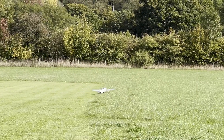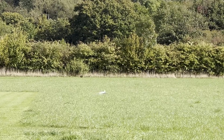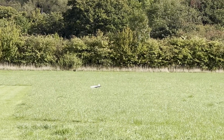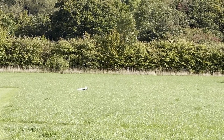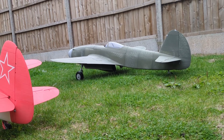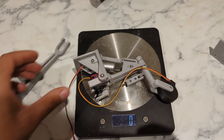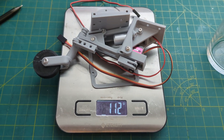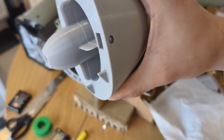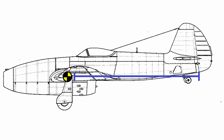This was the culmination of three months of design work. These results were sobering after the success of the Mach 4.2 — I lost sight of the fundamentals in pursuit of the right look. Before I designed airplanes I was an artist, and I'm still getting my practical experience with the constraints of this hobby. To get the weight down, I knew I couldn't run the tail retract. The retractable steerable tail assembly weighs around 112 grams, and putting that much weight in the rear of the fuselage meant adding compensatory nose weight — and since the distance from the CG to the tail is greater than from the CG to the nose, the weight ratio isn't 1 to 1.